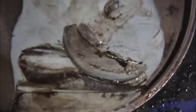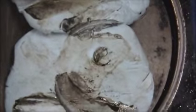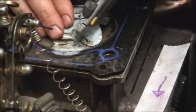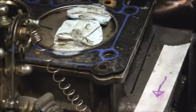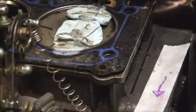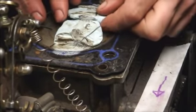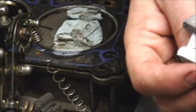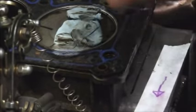So now if I cut the plasticine in half, I will see how thick it is in those two places. Exhaust valve. There's the edge of the valve, and that's the face of the piston. So we've got all that to play with, which is oodles.